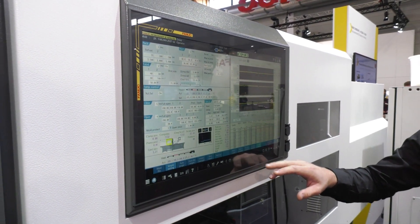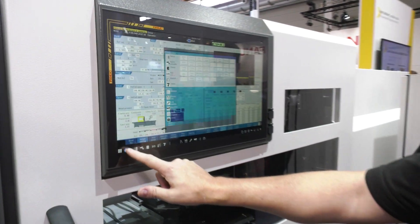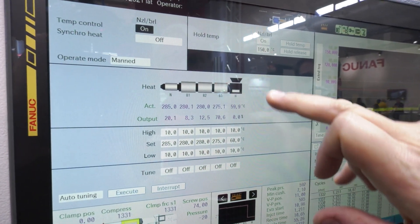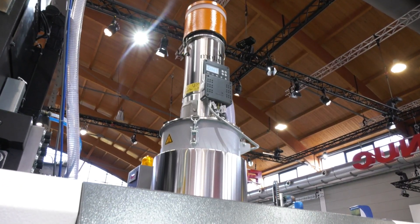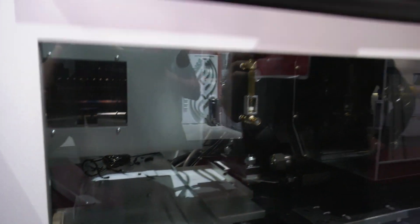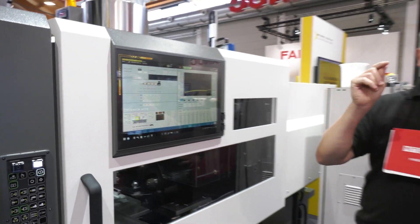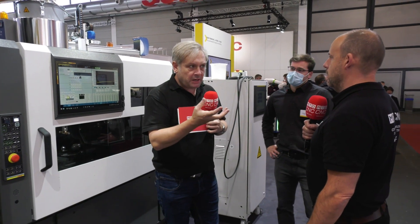It's a huge 21.5-inch touchscreen. I've been learning how to program this — Torsten is standing close by just in case I break it! If we go here, you can see the temperature: 59.9 degrees, which is up in this hopper here — that's where the pellets are drying, so it's temperature-controlled. Then it goes straight up to 275, and you can see it getting warmer all the way along the screw: 275, 280, 284. The temperature needed depends on the material — in this case plastics and TPE. These machines are interactive, so if you've got a different batch of the same material with slightly different viscosity, the machine will adjust automatically.